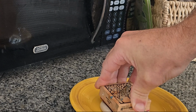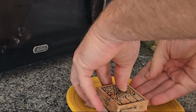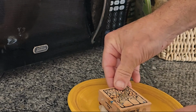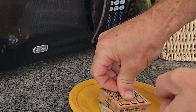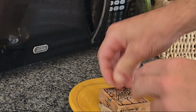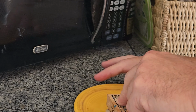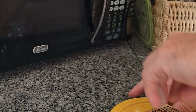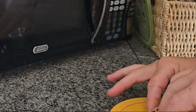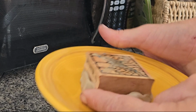I could have pressed the Impressive Putty over the object, or I could press the object into the putty. It doesn't particularly matter, you can do it either way. If I was going to do something that was on a wall or, say, a frame, it would obviously make sense to press the putty over the object. And the nice part about the Impressive Putty is you don't need a mold box. I'm just going to make little surfaces around the part so that the resin will stay in the mold, as you can see on the edge there.